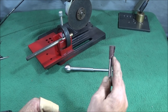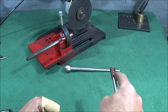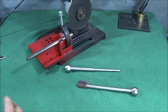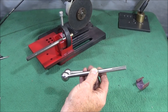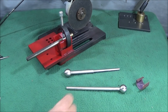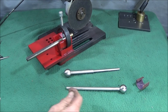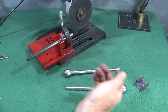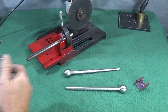It's really important when polishing bores or threads on the lathe to use one of these — you should never stick your fingers into the work or the components. I did hear a story several years ago where a man was polishing a thread on the lathe with the spindle going, and the thread caught his finger and actually wound his finger into that thread. He must have got some really nasty injuries from doing so — it must have been a terrible experience.